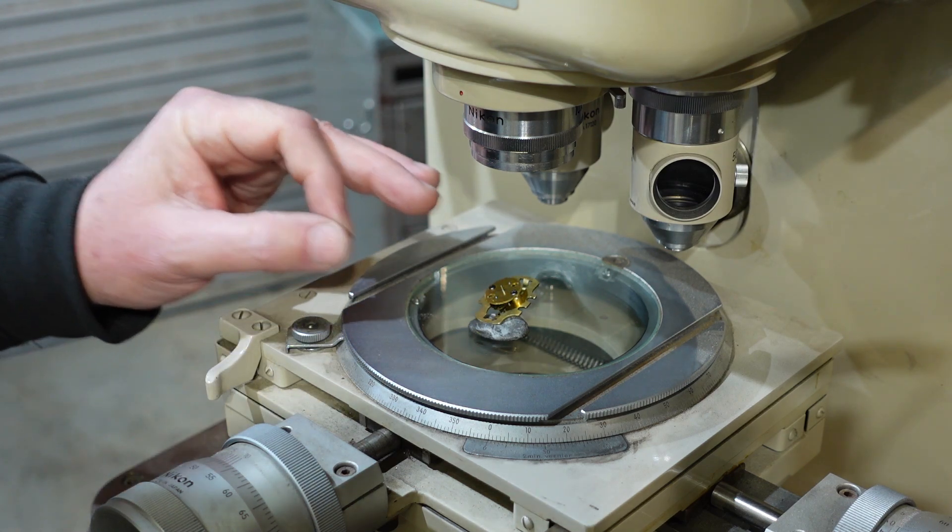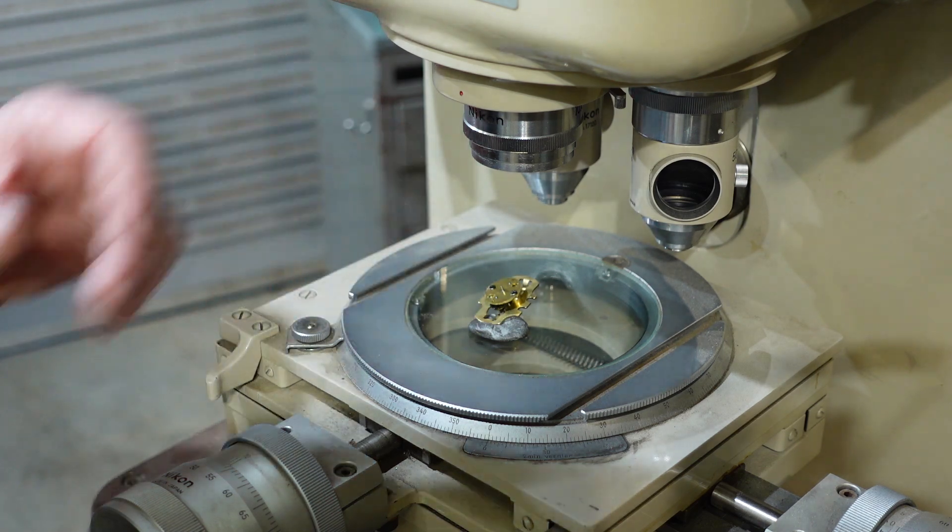This may be a little difficult to see but it's probably the best I can manage. You can see the gear teeth and they look reasonably well formed - the gears are on an angle so you're getting a thicker profile. But just down in one particular spot those teeth have been crunched - that's probably because of the drop. There are some good teeth all around but just in that one spot, maybe 15 degrees or so, the gear teeth have been crunched.